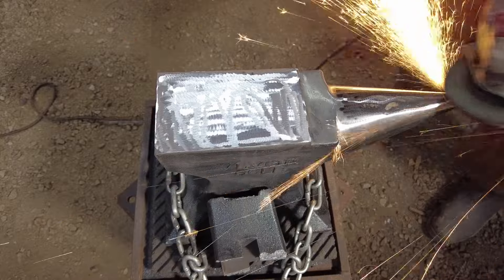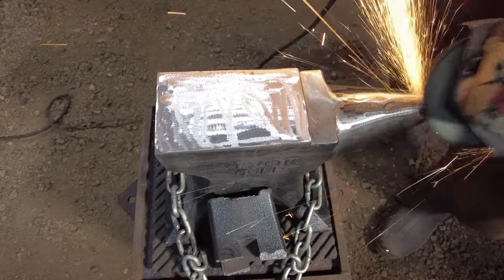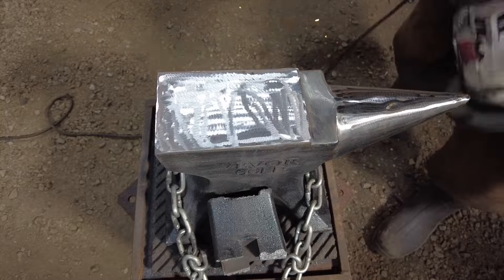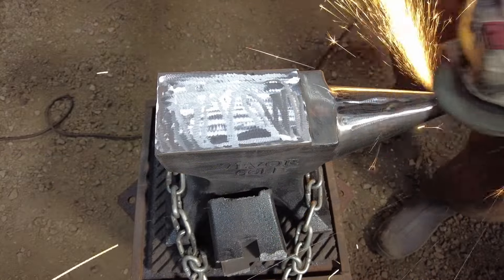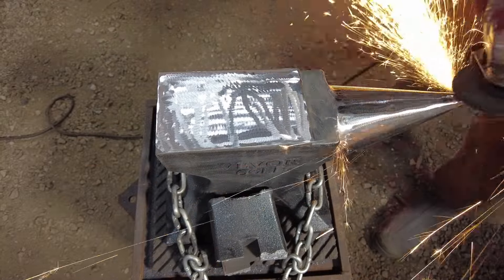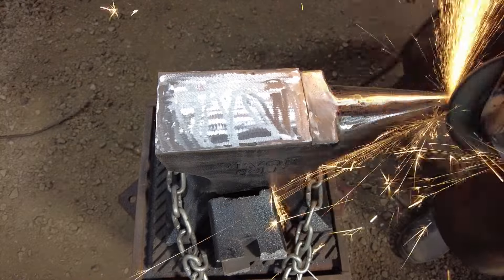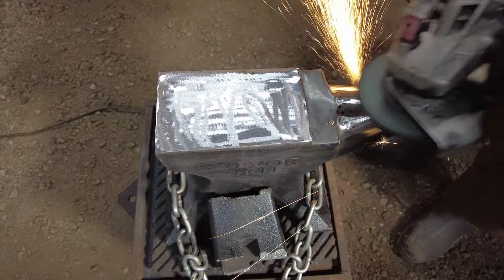After getting the face done I tackled shaping the horn. We put a lot of hammer marks into this horn, but it's an unhardened horn, so it was really easy to dress up. You can see how the shaping works with the stone wheel on the angle grinder — use it almost like a carving knife, power carving off little layers at a time, reshaping the horn to what you need. It took no time at all — probably five minutes to clean that horn and grind it down to where I'd like it to be.